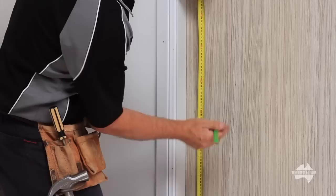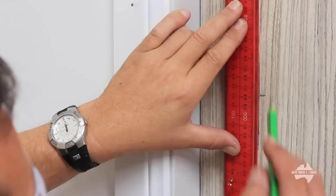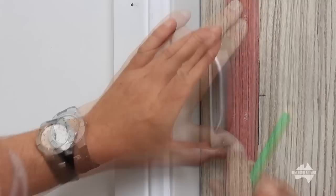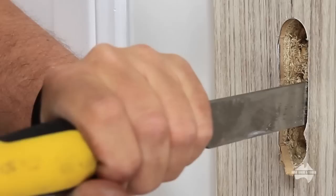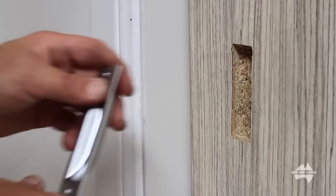It's now time to fit your architraves. Measure and mark out for flush pull handles. When using hollow core doors, ensure that you are in the lock block area. Using the flush pull as a template, mark out the area required. Now with a spade bit, pre-drill the marked out area — this will help when chiseling. Then with your chisel, carefully chisel out the area, and be sure not to go too deep into the door.